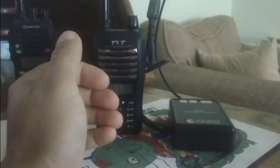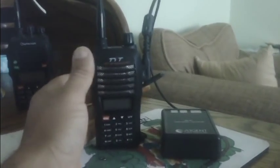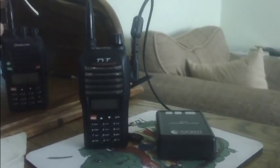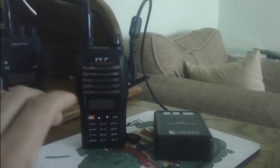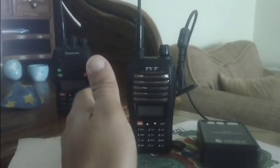So read the FCC rules, find out for yourself for your setup, but that's how I'm running things. But let's say that I take out that requirement of mine of having the access be digitally encoded, and I chose an analog signal to open this up, a privacy tone or PL tone or CTCSS tone, whatever you want to call it. That is 100% legal. Even the frequency shift. I mean, the GMRS frequencies are pretty specific to a single group of frequencies, but there is a lot of debate whether you could split the frequencies like that and use this system.